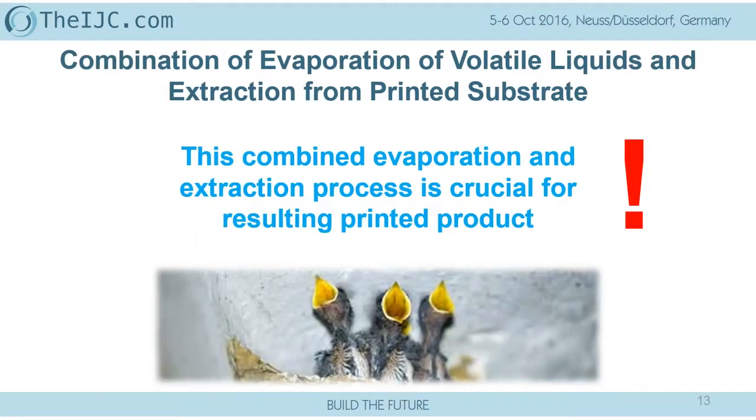And now, that's also something which is highly required. As I said, the evaporation to get the vapor is one thing, but second, to remove the moisture out of the drying chamber is important. So the combination of evaporation and extraction is a very crucial part. And if you are heating one thing and put later on a suction zone, that is already the first problem, because you might have in between already recondensation on the substrate, and at least it takes more energy to remove. On a lot of occasions, even the extraction system is not sufficiently designed, and therefore it's not operating properly.